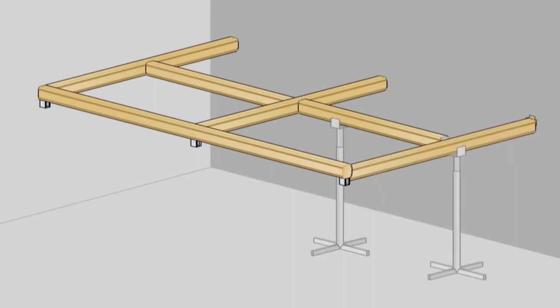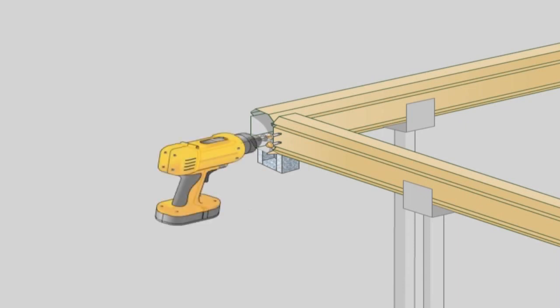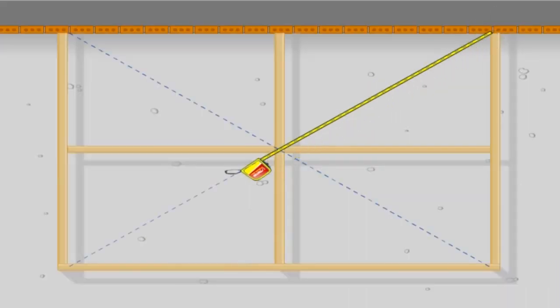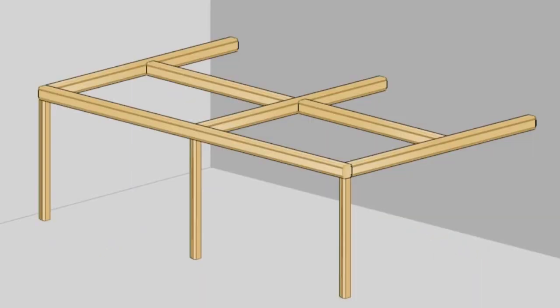Final end fascia beam. Slide the final end fascia beam onto the beam to beam bracket at the front fascia. Slide any purlins onto their brackets before lifting the end fascia beam into the wall or suspension bracket. Fasten all connections using two 10x16 hex head screws either side. Framework check: check the basic framework for squareness by ensuring the diagonal measurements are the same. Recheck that the falls are correct for the roof and gutter and adjust the construction prop if required.